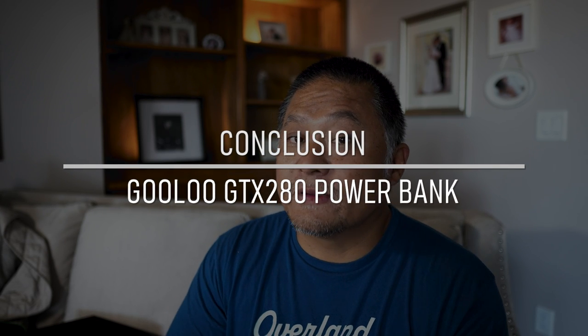As you can tell, the capacity tests show that the battery didn't achieve its full claimed capacity. This is actually quite typical for battery banks versus testing just the battery inside. The best DC discharge efficiency I've ever seen from any power station is about 87%. This unit only achieved 76.74%, which is a total of 214.87 watt hours. I attribute that to the fact that this unit is so small — they have to choose components favored for size over efficiency. The AC discharge test came in even worse at 59%, which is 165 watt hours, due to the inverter and how it's connected using the lighter socket. It's not a big deal to me though, because I don't plan on using the AC inverter much — I plan to use this exclusively for its USB outputs. Specifically, I think this is one of the best units you can get for a laptop with USB-C charging.